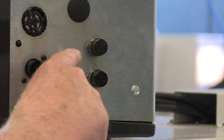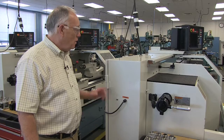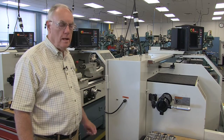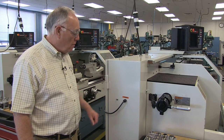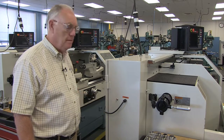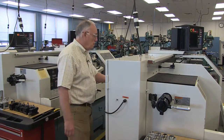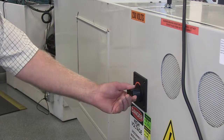To do so, we're going to hit this switch on the end of the machine. After turning off the control at the computer, you'll go to the end of the machine and shut off this switch. Then we'll come back here and shut off the main breaker. That's the procedure for shutting the machine off.